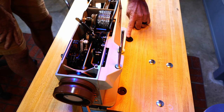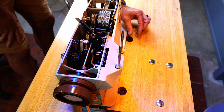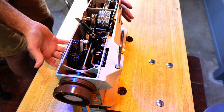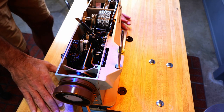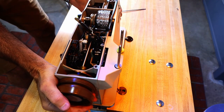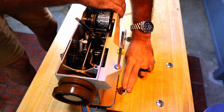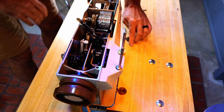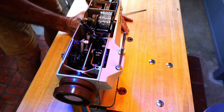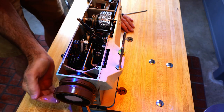So I've got these hinges kind of in the machine, and there's an adjustment in and out, so I'm going to go underneath the machine, loosen the set screw, and then that'll allow this machine to settle into place. And then once I get the machine in the hole, and these in their holes, I can tighten that up and it'll be adjusted. Now I can adjust this in or out. Also that. There we go. These are in place and set. Let's see. I can adjust this. Kind of center up the machine and the table.